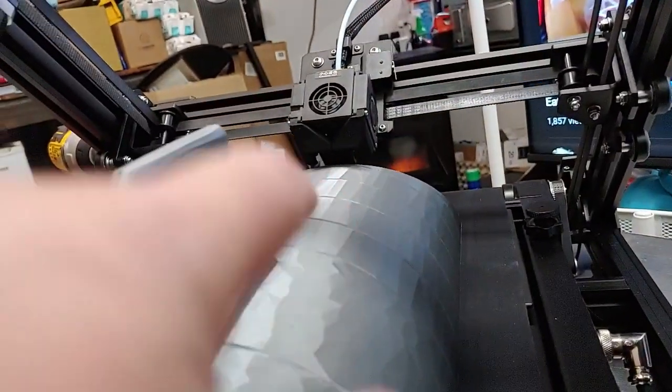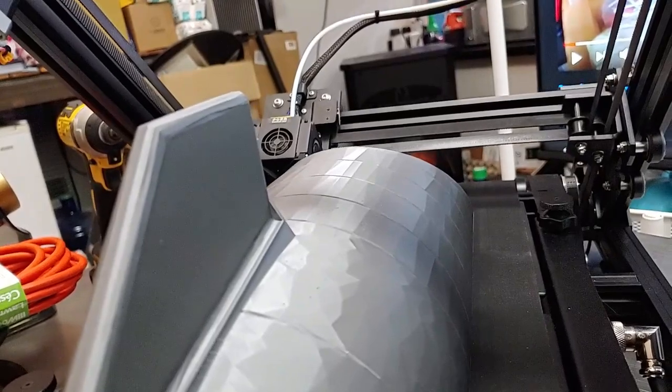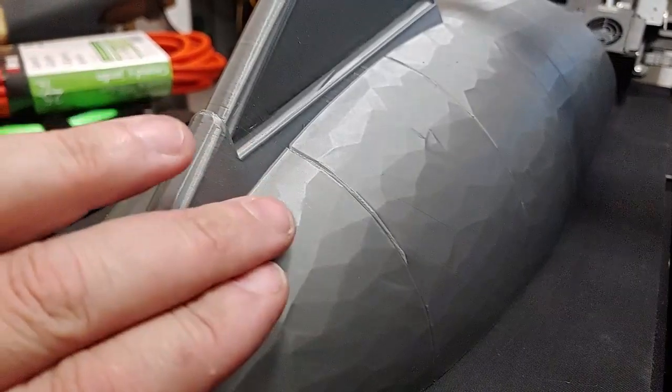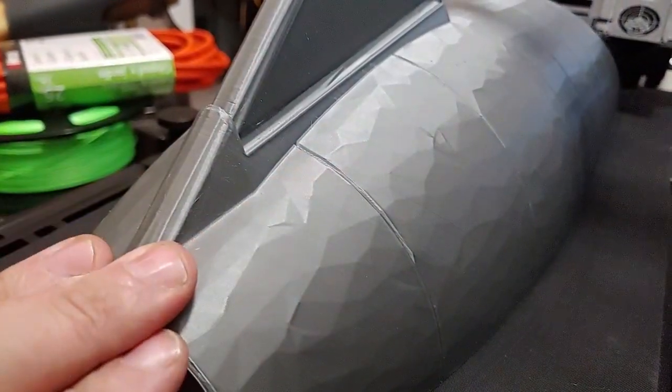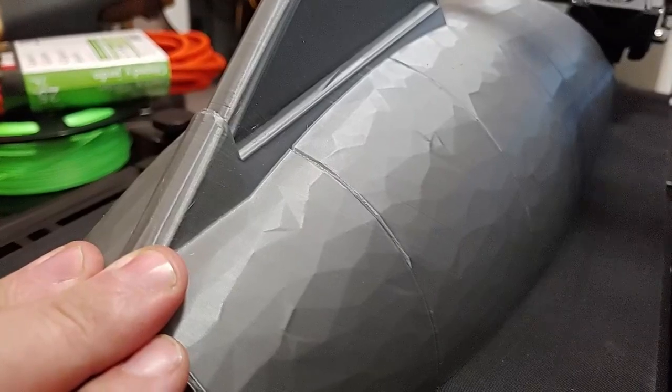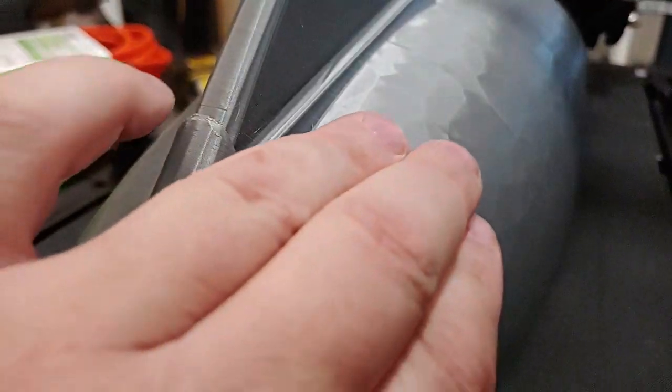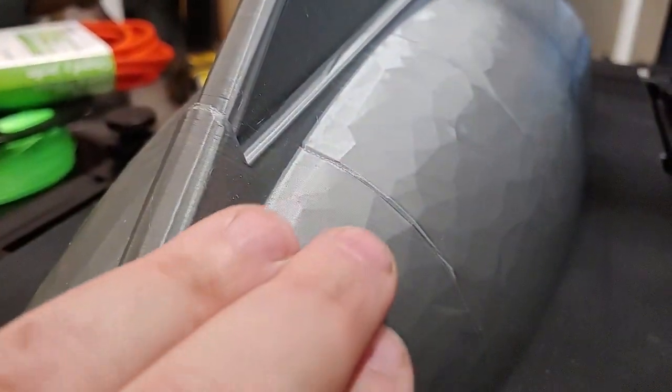Because of the 45 degrees, I didn't trust myself to go in there with pliers and pluck it off. Overall, it's pretty nice. The 45 degrees does cause an increased aspect ratio to the layer profile, so the layers are a little more pronounced, but they are pretty consistent — enough that I'm happy with it. I'll have to print a better quality model. This is also a beta roll of filament, so there are going to be inconsistencies in the color dyes, which will obviously manifest as banding. Very minor though — not a big deal. I'm going to paint this model.